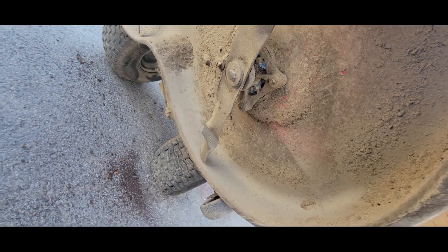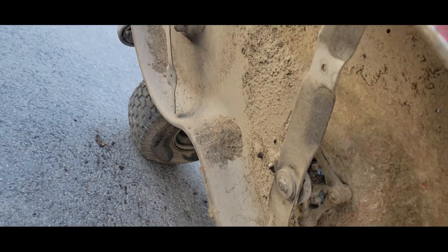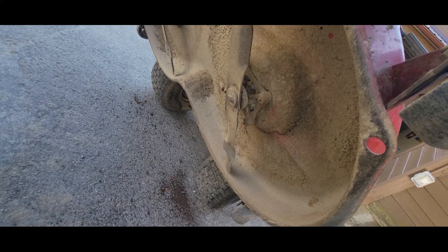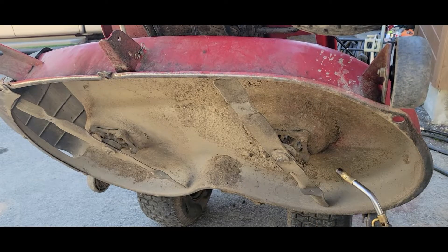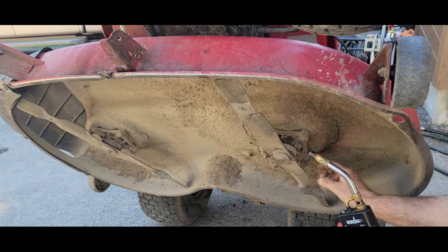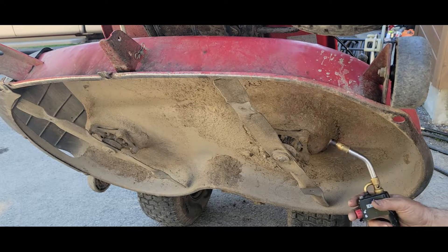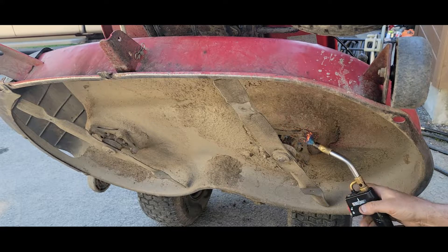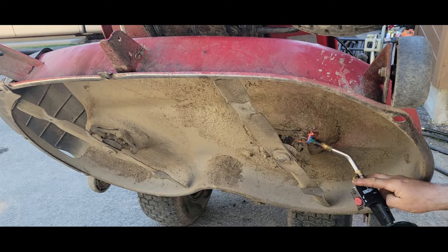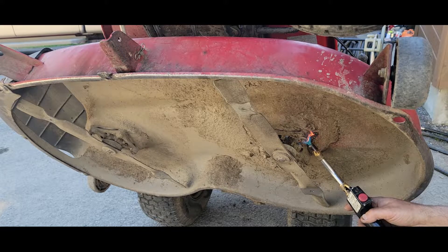Here are our blades and they don't look great. That blade over there has got a crack in the edge — they've got to come off, I don't want pieces of metal flying. I've got another set of blades I'll put on. Let me get a torch and warm them up — I bet those bolts come out a lot easier. I've tried this in the past and it actually works if you're patient. The bottom of the screw sticks out so it's prone to corrosion. If I heat this up it expands, then heating up and cooling down cycles will get them loose.